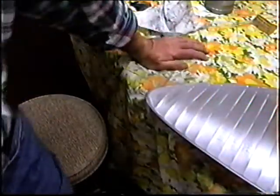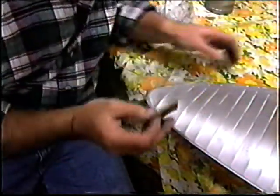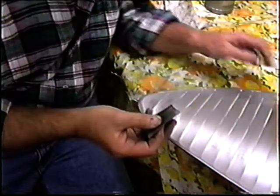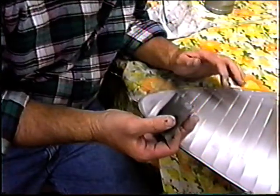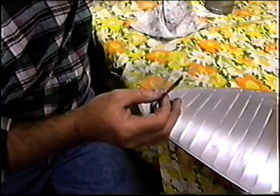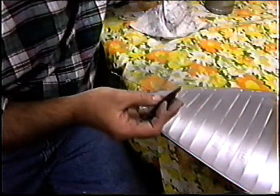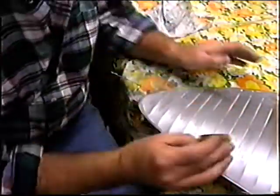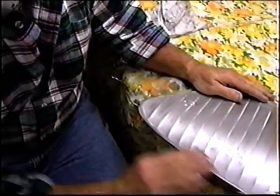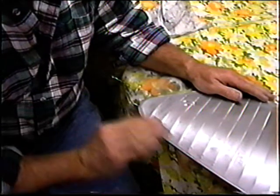Now one of the things I'm really careful of is, as I go by in each coat, I try to sand just a little less. I tried to see if I could work on my open bay areas with 600, and it was getting a little bit risky. Risky being that you start to go through in spots. So I'm back to my 1200 routine. What I'm trying to do now is hope to get this done in maybe one or two more coats. Who knows.